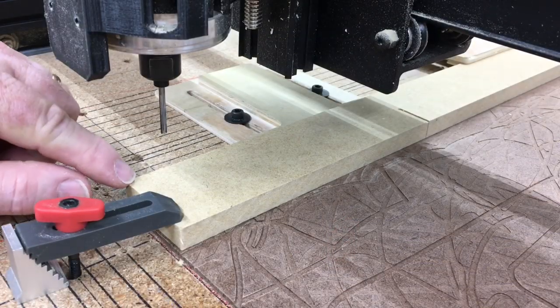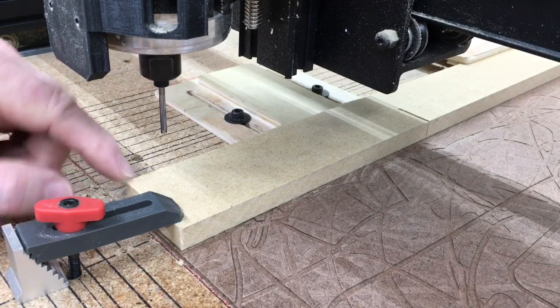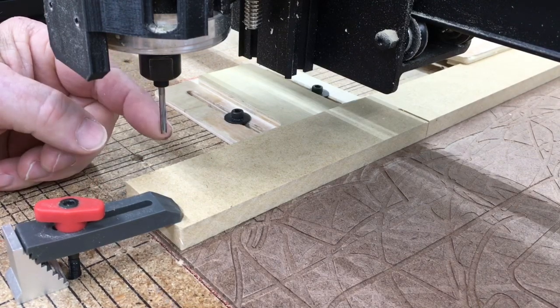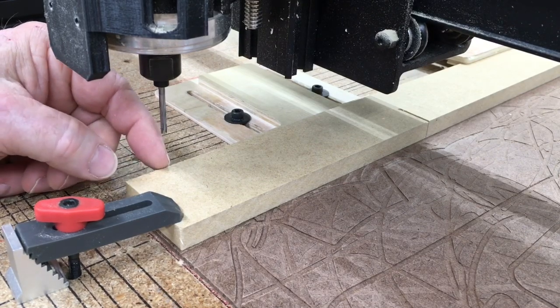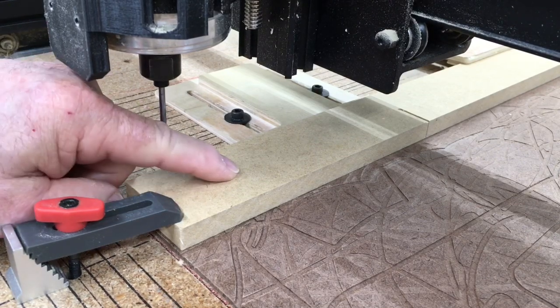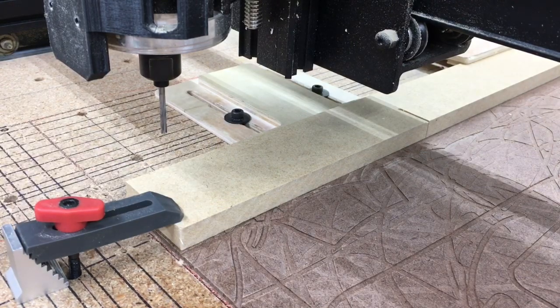It's not even really important to bring this all the way down to the bottom corner. I'm going to set the XY axis right here, which is actually one inch up, because what it's going to do is move over an inch and up an inch and put the hole right there. So let's go ahead and give it a try.